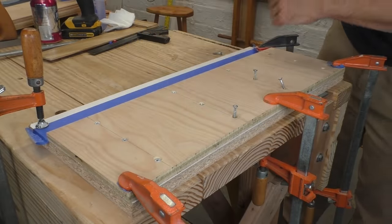The next day, I add long screws for a solid hold, and then I use my plane to trim off the little bit of the fence I left overhanging the track. At this point, I could stop and have a totally functional shooting board, but that fixed fence would give us trouble eventually. If we look at my old shooting board, we can see it's still square, but the fence has gotten really chewed up over the years. It's not supporting the edge of the wood anymore, and I can tilt my plane without even noticing, which is very bad for accuracy.